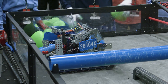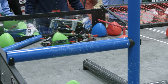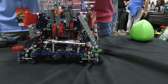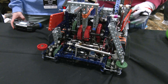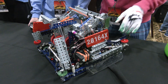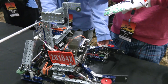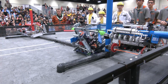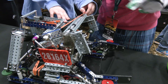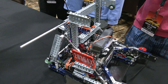Ron, let's talk about the autonomous arm. So for our autonomous arm in the back, it helps us descore the tri-ball in the match loading zone, which helps us get our autonomous win point. It's very reliable — we've had many successes with it and I think everyone should add it onto their robot. And then for our end game, we have a one-piston end game which helps us hang and also helps our side hang. We have a passive horizontal bar hang — we're able to slide right up onto the bar and it hangs. We get an A-tier hang on both hangs. We have a standoff which starts back with tension, and right when our end game releases, the standoff pops out which helps us ride along the barrier and hold on to the bar.